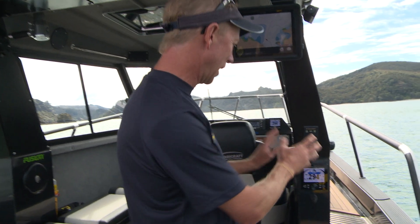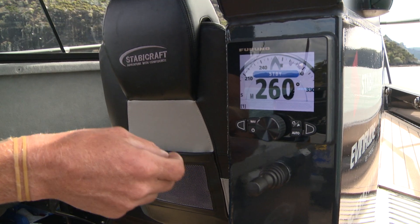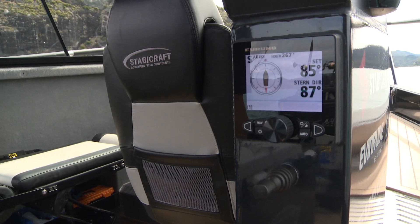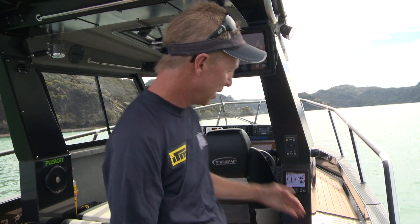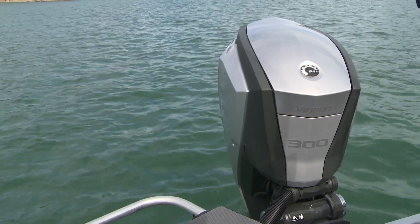Another cool thing about the Autopilot — I've got another unit out here, and if I select the station, let's say I've marked some fish, I can pop it in reverse. With one push of a button, I can select this wee mode here — that's sabiki mode. As soon as I select that, I don't have to steer the boat anymore. I pop it in reverse, and the boat now knows the orientation, where I want it sitting, and it just keeps adjusting the motor to keep me right over the fish marks.